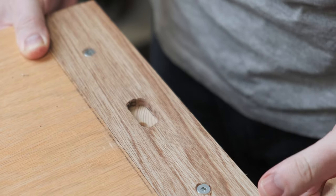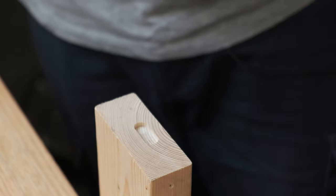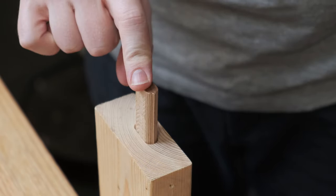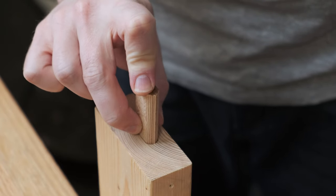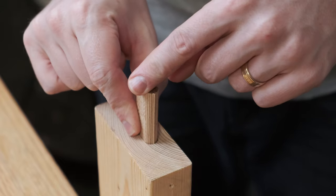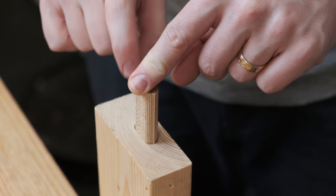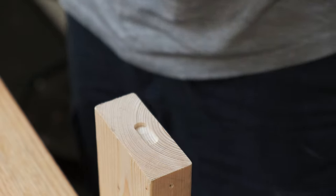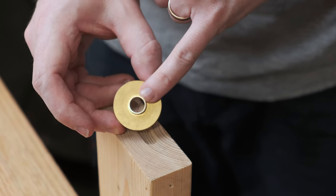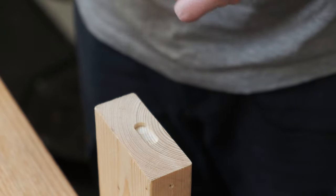So at the moment this jig has the regular 10mm domino template installed — it's just screwed in, I'll replace that with bolts at some stage. We're still working on this, still need to make the whole box for it to sit on. You can see that I've done a test cut to make sure the theory works, and a 10mm domino fits in just fine. It is very slightly loose along the length, but that doesn't matter so much — the glue surface is the important thing. It's just a hair looser than what I prefer, but it will work with glue. The problem came from measuring the guide bushing, which was about 0.1mm smaller than I thought, so all of my maths was off when I calculated the width of the template.